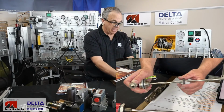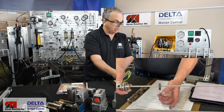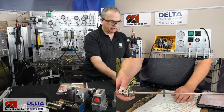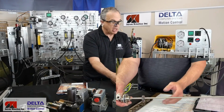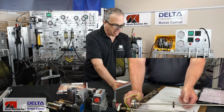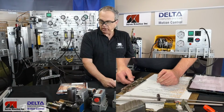And if you know the M series of graders by Caterpillar, like a 12M, 14M, 16M, 24M, the steering on the front end of those graders now is basically a servo loop. And you might say, hey, I didn't see a valve mounted on the cylinder. Now the valve is back closer to the cab, and you might say, hey, that doesn't sound like a very stiff servo. Well, it's not necessary for the steering to snap into the kind of action that you see as the snap action motions for some factory manufacturing, and so it can still be done quite accurately. It's just not required to be as snap fast as some other factory servo applications.